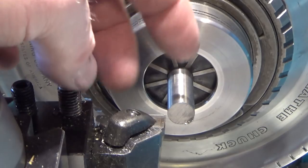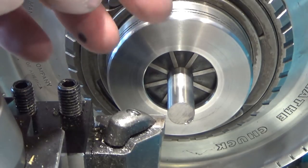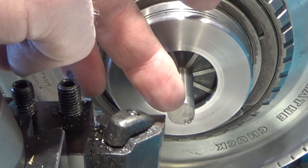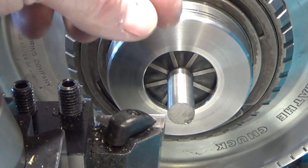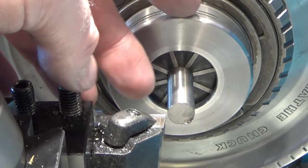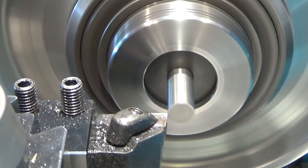I've got some half-inch shaft here — it happens to be A2 tool steel, but the main reason I use it is because it's precision ground, which makes it really nice. I don't have to deal with dimensioning at all and it's got a really smooth finish. I need to put a three-eighths inch section about three-quarters of an inch long, and then another half-inch section — I'll just leave the main diameter. My two camera fixtures: one uses three-eighths, the other uses half. So we're going to start by facing this, then take it down to three-eighths. My feed rate is currently set at 9 thousandths per revolution.